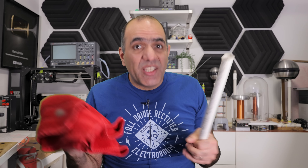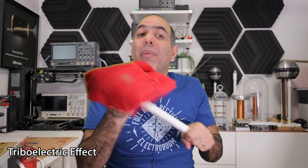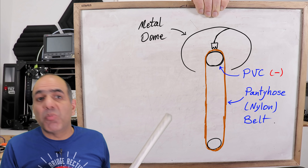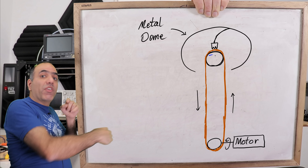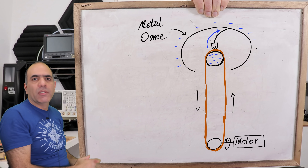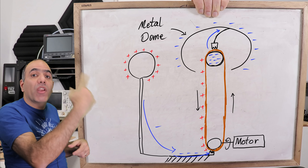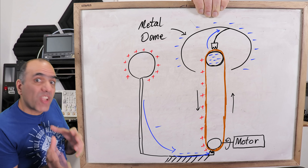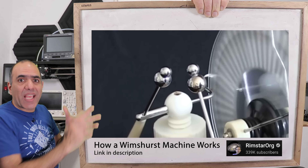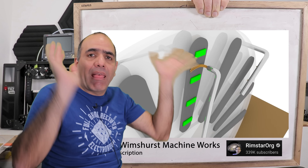Let me explain what I was gonna do. As I explained in my old video, the Van de Graaff works by the triboelectric effect — when two non-conductive materials rub against each other, charges from one stick to the other. In my case, I have pantyhose as the belt that goes around PVC. When rubbed against each other, PVC sucks electrons from the pantyhose rotating belt. Those electrons are picked up by a brush charging the top dome negative. The positive pantyhose rolls down and sucks electrons from earth or an adjacent ball, becoming neutral again going up. So it pumps charges from one side to the other.